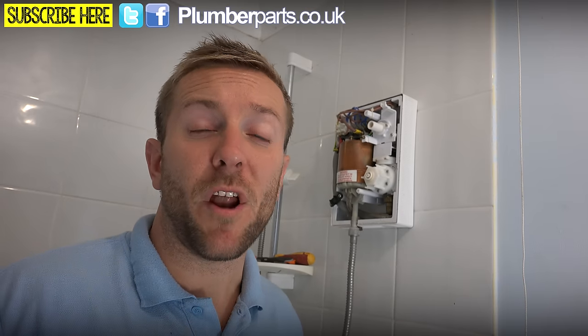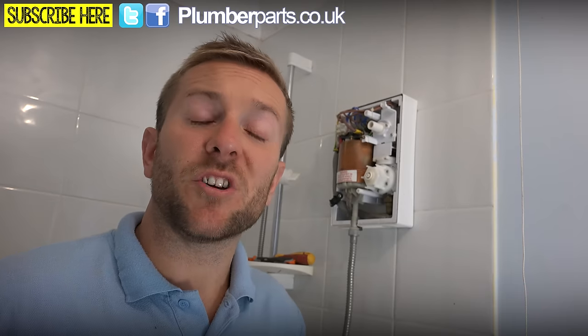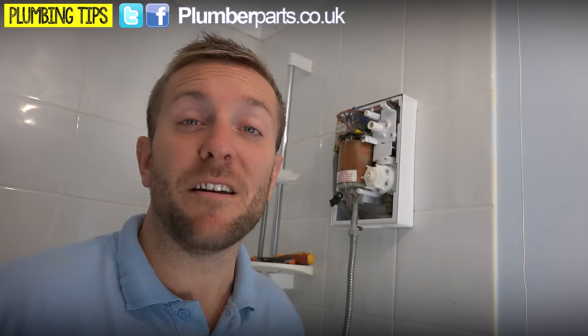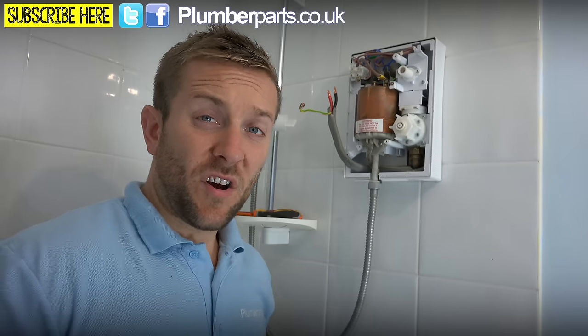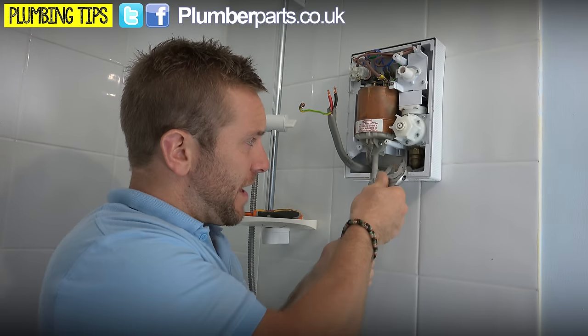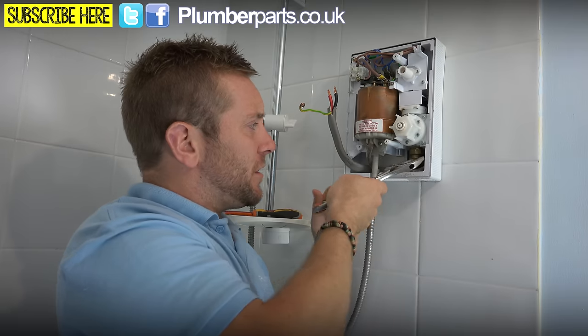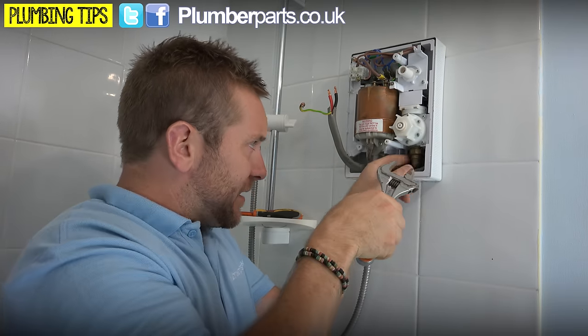Before you do that, you might want to open up the other taps in the house just to make sure that all the water pipes have been vented through nicely and you won't get a load of gushing water coming out in a minute when you come to take that off. It's nice and easy to find the water supply. We've just got it in there. Nice little adjustable. 15mm adjustable there, so we should be able to undo that easily, get that slackened off.